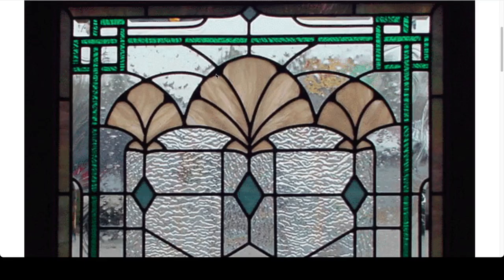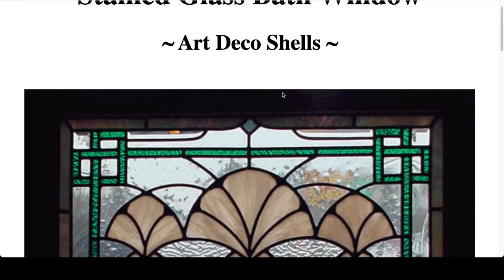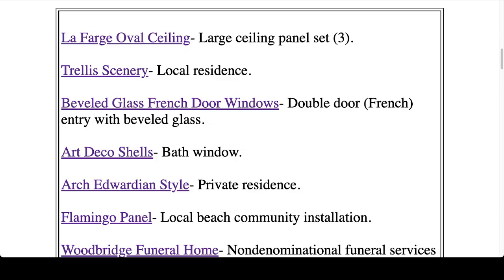So what I was getting at is, you fill this in. You're really not going to have a big hole here. Tiny little triangle. You jump your leads. In a video one day, I'm going to show you how to solder joints and then actually jump. Using 50/50, when you solder this, you solder it as normal, and the little bit of void you have here, I'm going to show you how to jump that and fill that void where it looks like one continuous joint right here. It's not hard to do. And again, using the high tensile lead, the success rate is there, all right? So I just want to show you that.